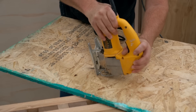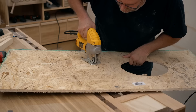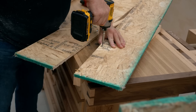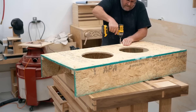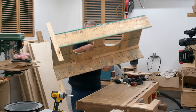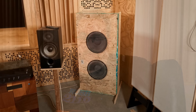I have an old piece of half-inch OSB that's two feet wide and four feet tall. Like I said, this is quick and dirty — you just need to cut two holes in it for the two woofers. I'm spacing them apart because I want to be able to cut this thing in half later to have two speakers in the room. I also cut strips of OSB eight inches wide and fastened them as wings out the back, and added feet to the bottom so it wouldn't tip over since these woofers are pretty heavy.